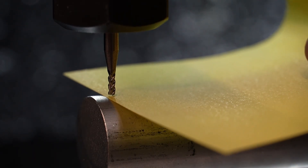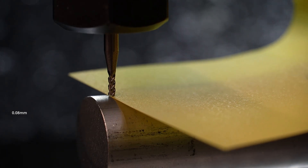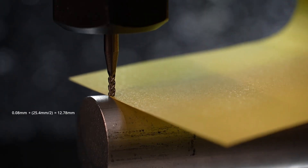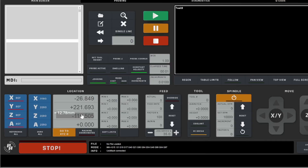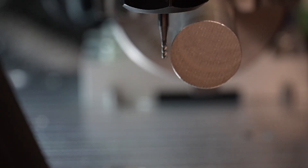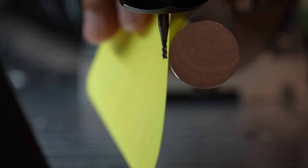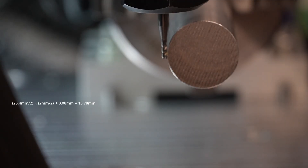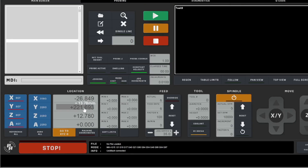Once the paper gets caught I know I'm about 0.08mm off the top of the part and about 0.08mm plus the radius of the material away from the centerline. I can click the Z work coordinate position in Mach 3 and type that number in on screen. To locate the Y axis work coordinate I'll do something similar, this time very carefully jogging behind the stock until I squeeze my piece of paper. My tool is now a distance of 1 stock material radius plus 1 end mill radius plus the thickness of the paper behind the Y0 position. I could have done this from the front of the material but I did it from behind to get a better camera angle, and that means I'm inputting a negative number in the Y coordinate.